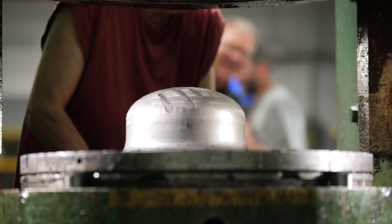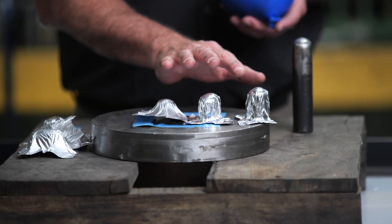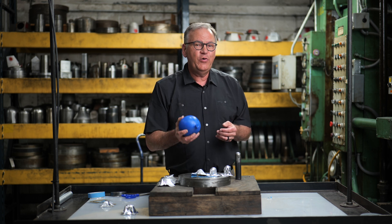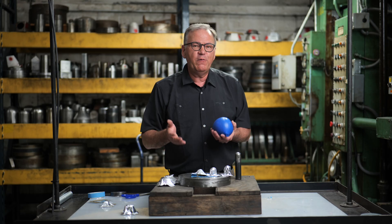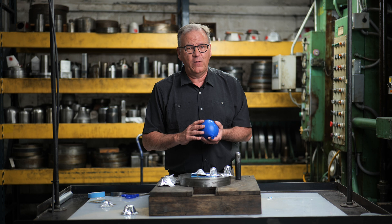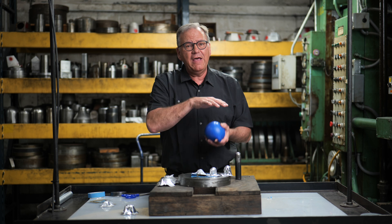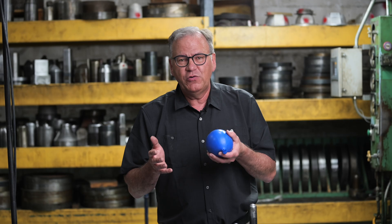Using this tabletop example of hydroforming, we went from a very ugly part to the beginnings of hydroform, to more of a full depth. We haven't totally gotten there — if you were on a press with full pressure and using a bladder instead of a balloon, you can get to a part with no wrinkles that could trim out and be perfect. But hopefully what you're getting is an understanding of the very basics of hydroforming and how it's different from stamping. Thank you for watching this video. If you have an interest in learning more about higher levels of hydroforming, we have several videos that take you to much more advanced views of what we can do with an actual press — so go check out our other videos and continue to learn about hydroforming and what it can do for you.